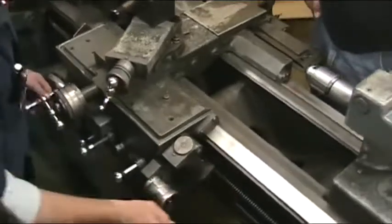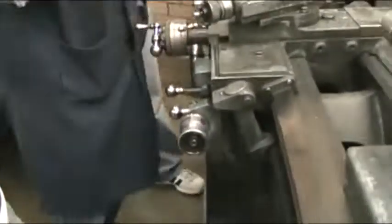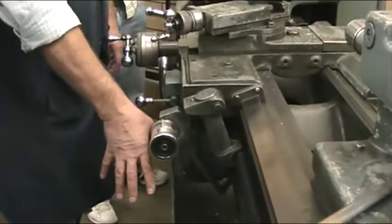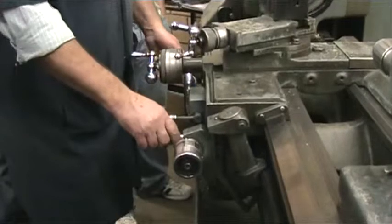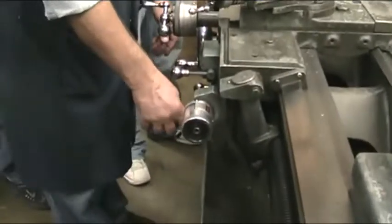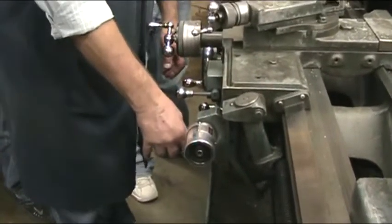But if you look right down through there, you can see that there's just a clamp. It has this thread in it that's split in two. It's called a half nut. And you just lock it down by pushing this down. And when the threads line up with the threads on this, this will drop in. It'll actually go on every line and every half line. So right here it'll go in. Right here it'll go in. Right here it'll go in right there.